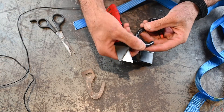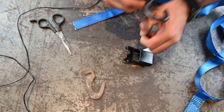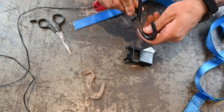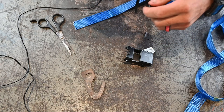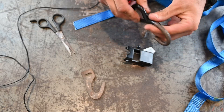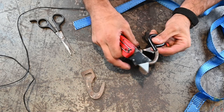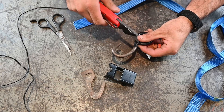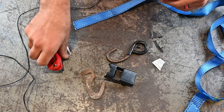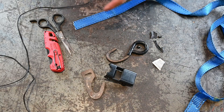I have scored it all the way along the back, and now as you can see it's just a coating — it's not adhered to the metal. We need this off for me to be able to weld; I need bare metal. I'm not too worried about the rest of the material down here because I'm going to cut this hook right there and that'll come right off at that point, so I'm going to bust out a grinder and start grinding everything down and making my cuts.